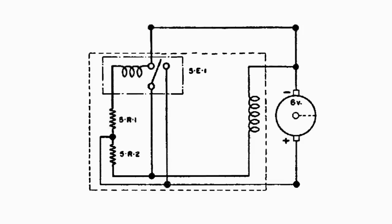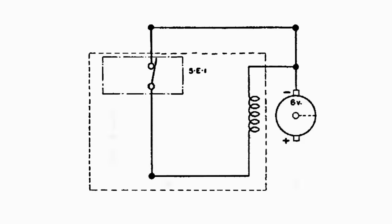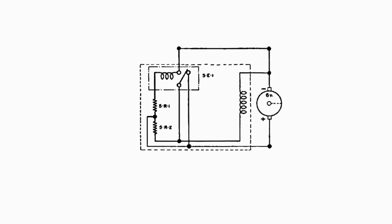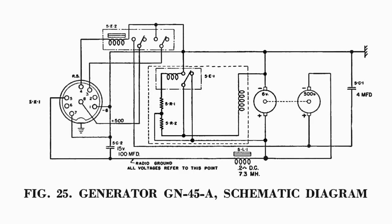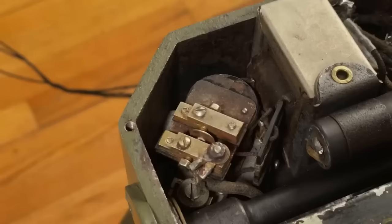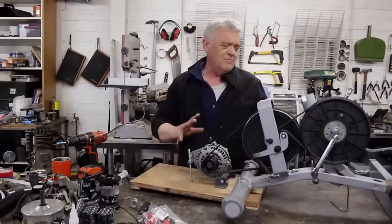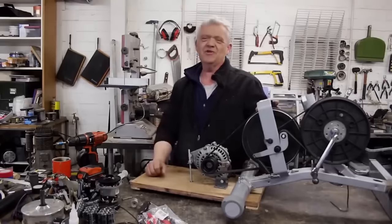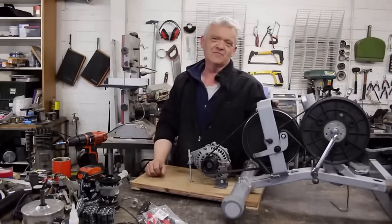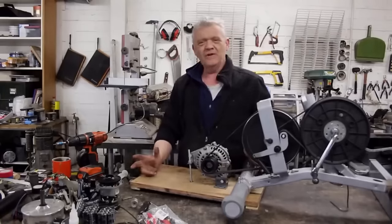When the signal from the low voltage commutator exceeds an adjustable threshold, a coil in the regulator pulls a reed switch away from the normally closed position. A resistor is connected in series with the generator field coils to dampen the system. If that doesn't reduce the output voltage enough, the reed continues to move until it contacts the other side, which shorts out the field winding and effectively turns off the generator for an instant. Because of this negative feedback, the output voltage remains approximately constant even if the user turns the crank too quickly.